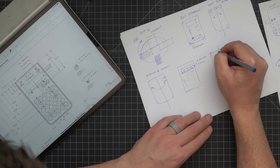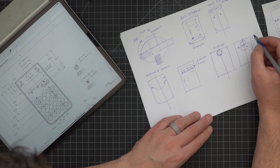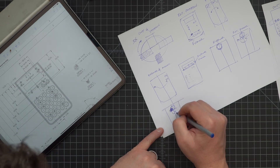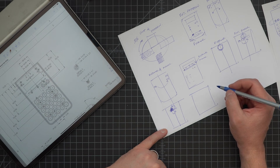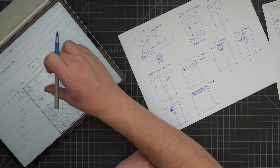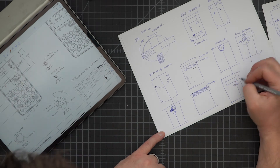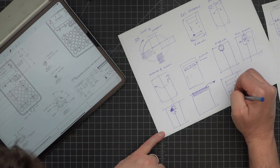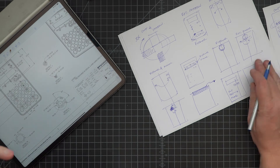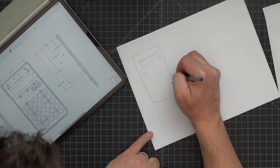Step 14: create the basic battery holder shape as a full circle. Step 15: create the rectangular features under the battery holder circle. Step 16: cut away material to produce the angular cutout. Step 17: cut out the large area near the top of the calculator, which from the drawings is not as thick as the other parts. Step 18: create a reference plane in between the two small buttonholes so that features can be added to one hole and then mirrored across that plane to the other. Step 19: create those features around the small hole and mirror them.